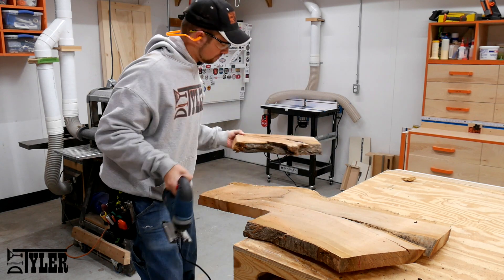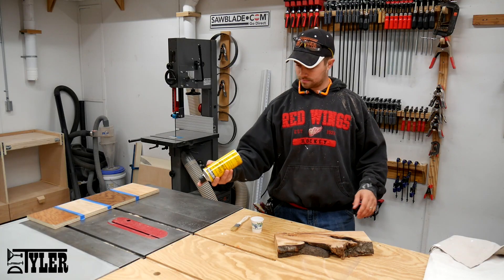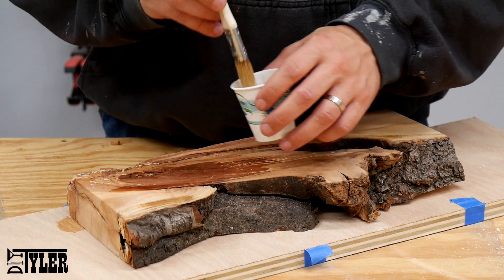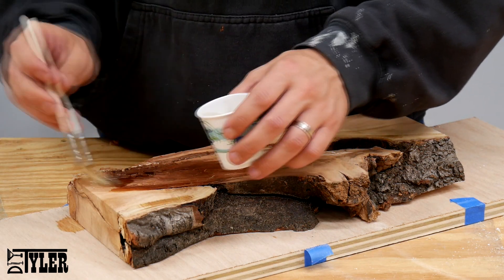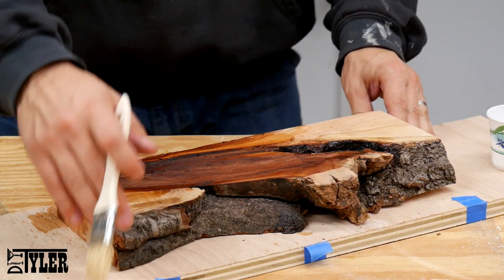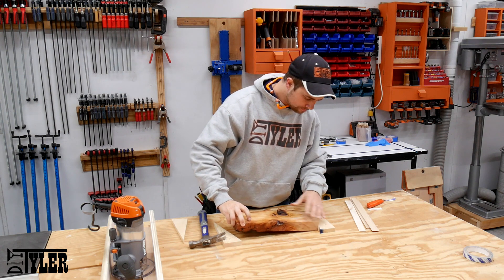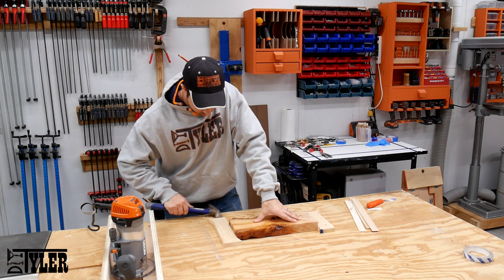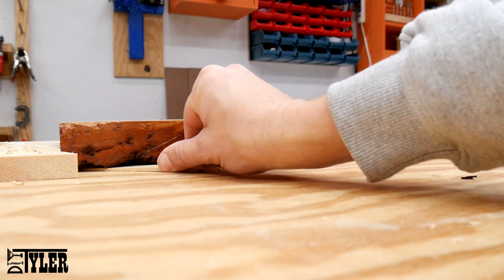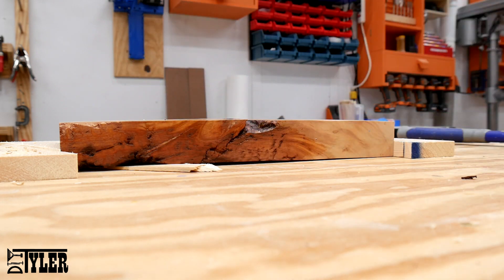I began this project by cutting the portion of the wood that I wanted out of the slab using my jigsaw. Now there were quite a few portions of this wood that were slightly rotted, so I used some Minwax wood hardener to harden everything up. Basically this smells like a very diluted CA glue, so I think all it's doing is just stabilizing the wood. I soaked a ton of that stuff into the wood, let it set for a few days, and it was hard as a rock. Using this technique to flatten the slab is a little bit of overkill, but I wanted to practice the technique before using it on much larger, more expensive slabs.